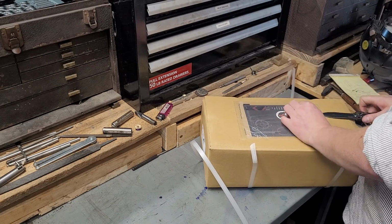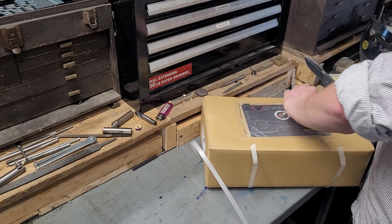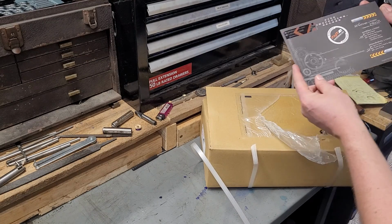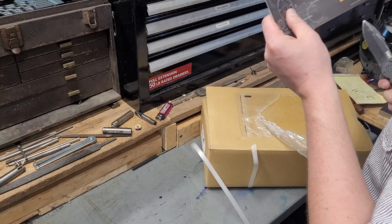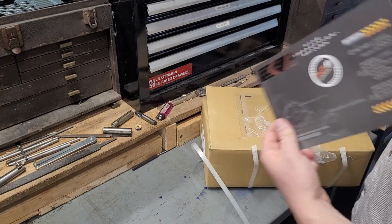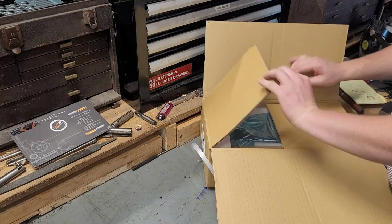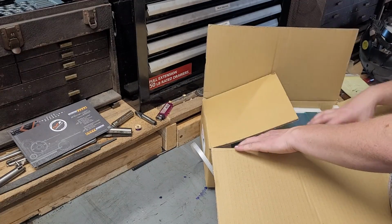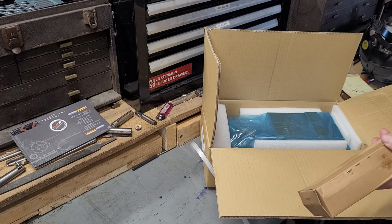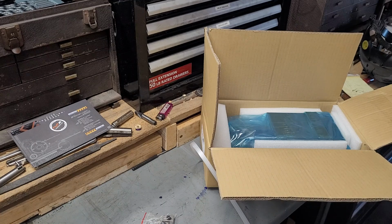I think what we could do later on, not today, is go look at this and compare it and see what we think it really is on my surface plate. Because perpendicularity within 0.5 thousandths and parallelism within 0.5 thousandths, that's pretty good. It's not perfect, but it's pretty good. And I think for milling machine work, that is sufficient. And one of the things to remember, guys, is sufficient is really all you need. If you try chasing perfection, you're just going to stress yourself out.